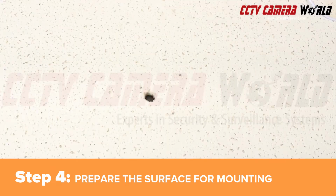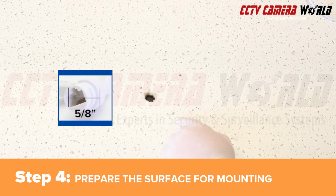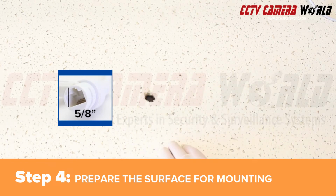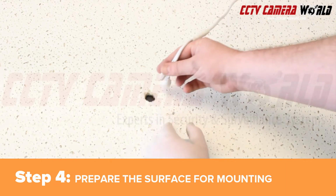For the screw holes, we used an 1/8 of an inch drill bit. For the pigtail, we used a 3/4 of an inch drill bit. The widest diameter on the pigtail surrounds the female RJ45 jack and is 5/8 of an inch. We used 3/4 to make sure there is enough room for the pigtail to fit through.